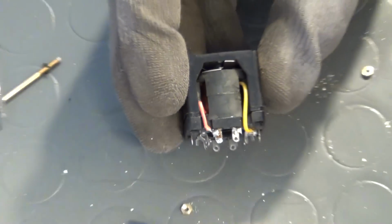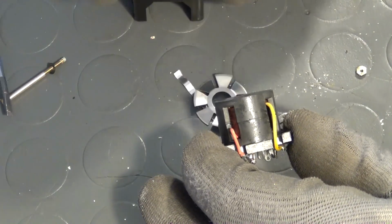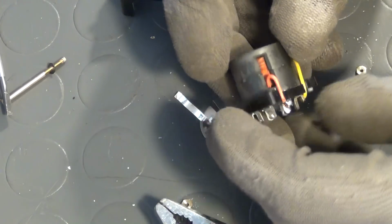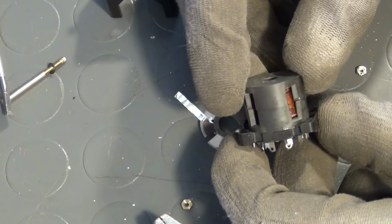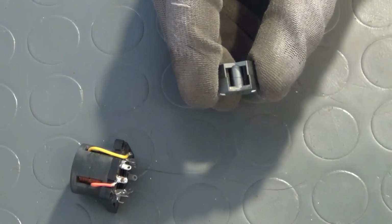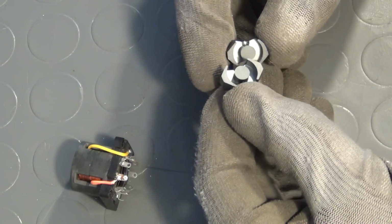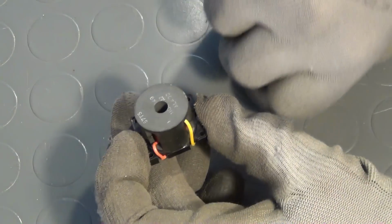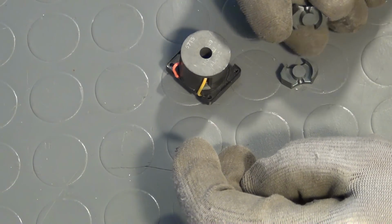Inside the other box are, again, inductors of yet another design. The winding is actually partially encapsulated inside the ferrite core. This core shape is called a pot core. And it is quite similar to these RM6 ferrite cores, which I just bought the other day to make storage chokes for miniaturized switching converters. It's interesting to see that not really much seems to have changed in 50 years when it comes to the design of inductive components.